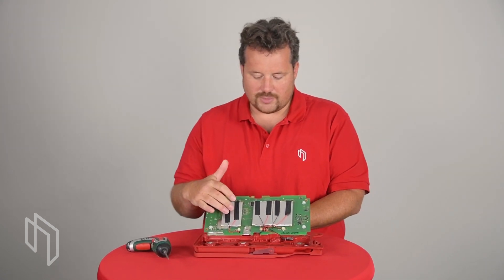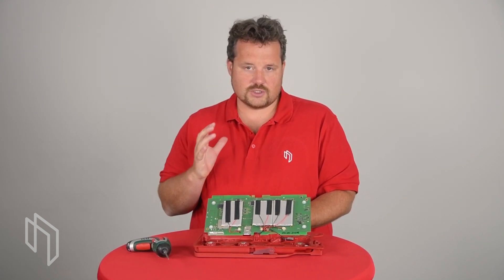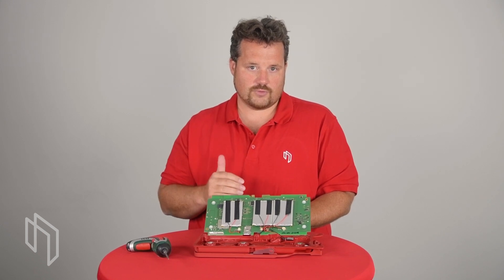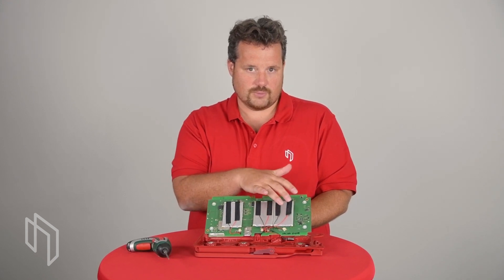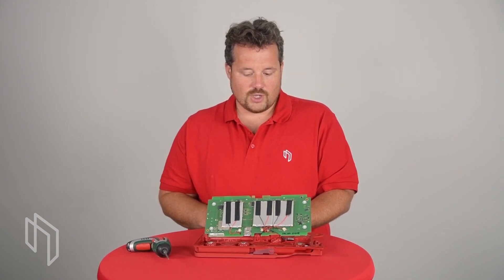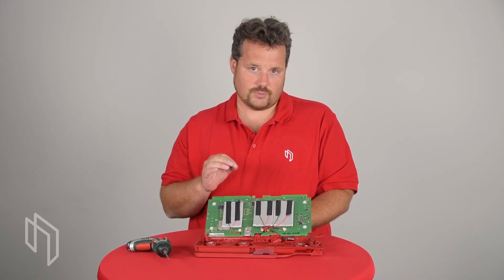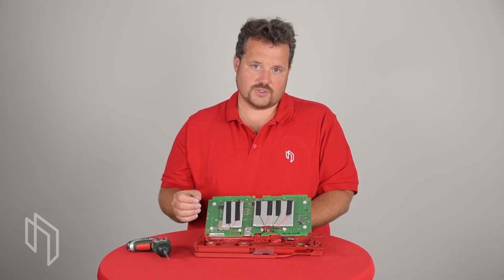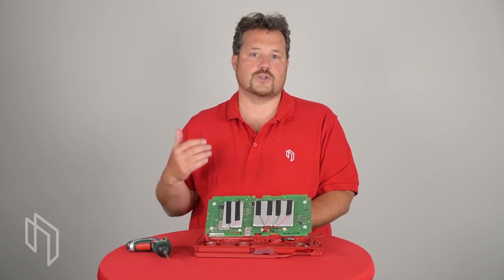Some of you may know that this is the same battery form factor as we have in our active boxes. The critical part of the design of this box was to be able to run for a full race day — for us that's 12 to 18 hours — out of those three batteries. To achieve this form factor, we have 45 watt-hours of lithium-ion in here, meaning it's no problem at all to fly with this box because we are well below the regulation limits. You can take six of them in a backpack and carry them up a mountain for a trail run, for example.